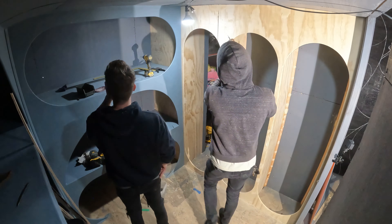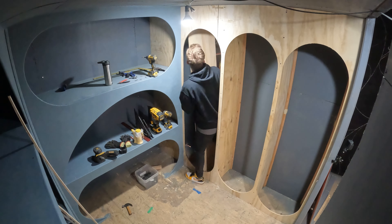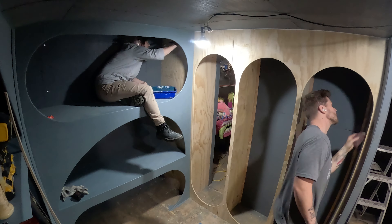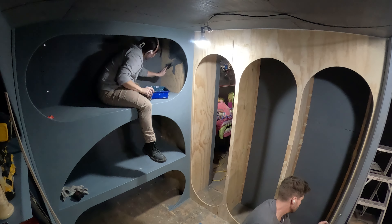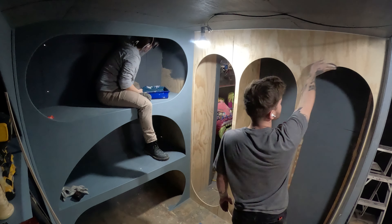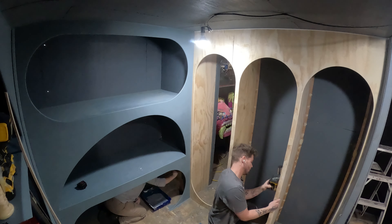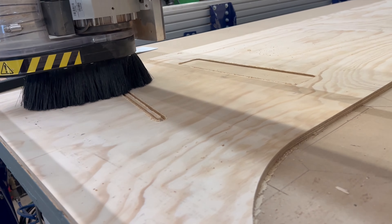Adding the lockers with these dividers attached to the bunks, this whole structure is incredibly rigid and strong now. We're really happy with how it's turned out structurally, but now we have to make it look good — look like it belongs in space. Lots more paint, but not just paint: we've mixed in at various stages some rock hard water putty with the paint, which when we let it dry and then sand it, the surface we get is much smoother and harder than you'd get with just latex paint on plywood. We don't want it to feel like plywood — we want it to feel like it belongs in a spaceship.